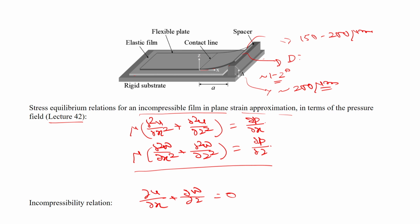If it is not incompressible, then also it can be done, but for the time being let us consider it to be incompressible. So, we need to solve this equation, and we want to see which terms are more significant, because it is a partial differential equation, it is not easy to solve analytically. But we can do that by making some suitable, valid assumptions, which we can obtain by doing what is known as the dimension analysis.